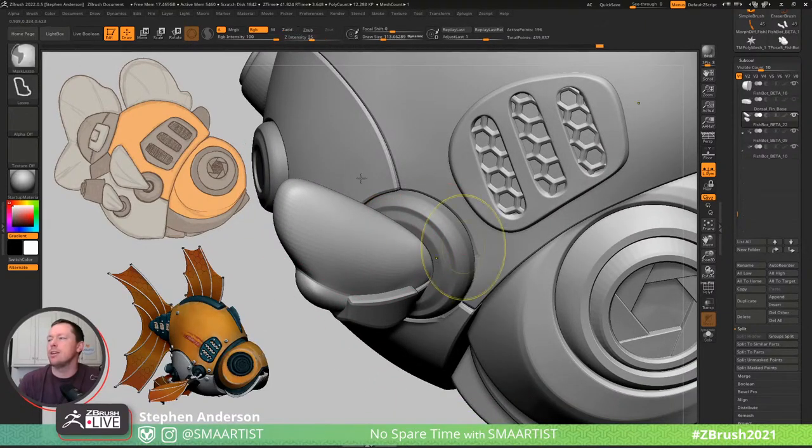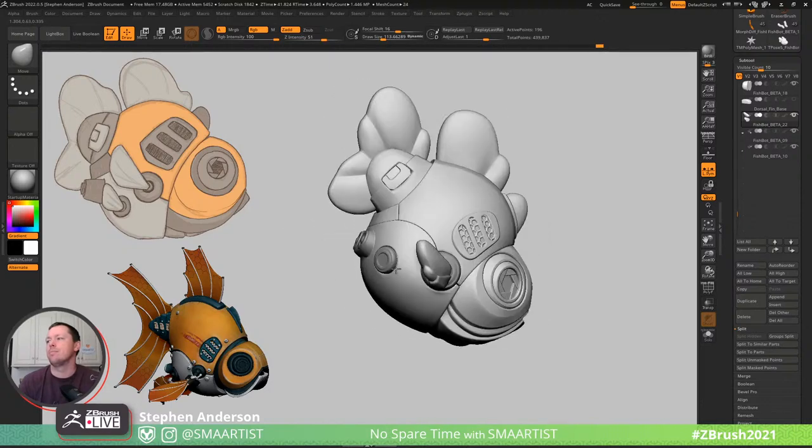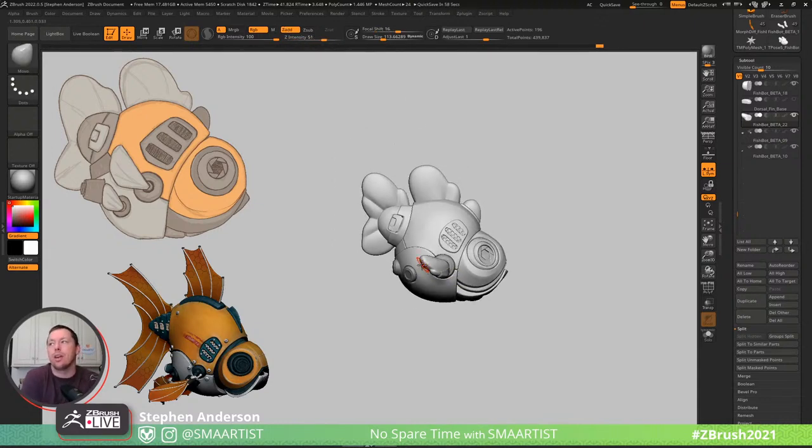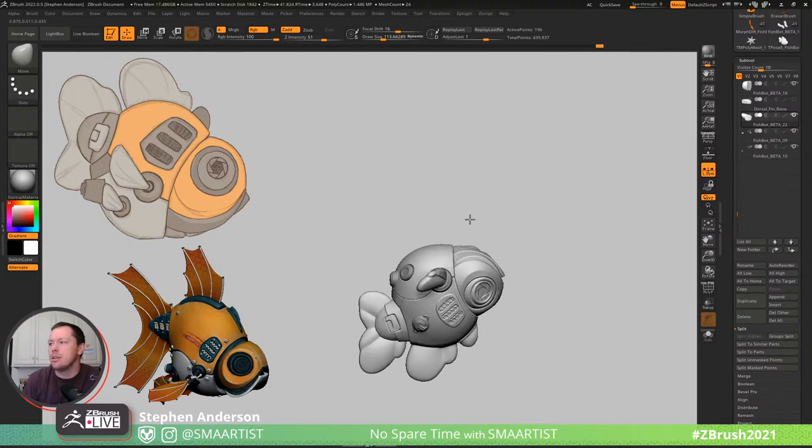One of the things I want to be sure of is that this is going to be sturdy when it's cast. I'm going to need to create what's called sprues. When I create all these different little parts, I'll probably cast it upside down like this. And then I'll have a vent going between the fins, probably, possibly one going between here and here too, since these are high points where I need to make sure I don't get bubbles. And then I'll have a vent coming up from the fins, and my pouring sprue coming up from here, which will get cut off after it's cast.